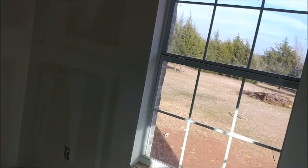And that's just about it. When I come back, I'll have that little bit of ripple to sand. And I always touch up before I sand. I'll come in here with a 6-inch knife, and I'll just touch every little bit insignificant off, knock down some pieces of trash or whatever, and then I just barely have to sand it.